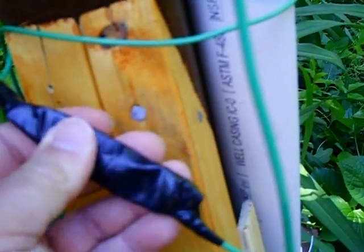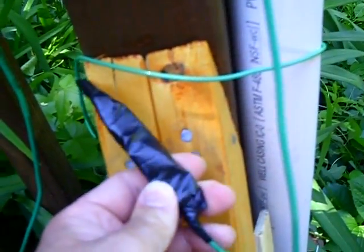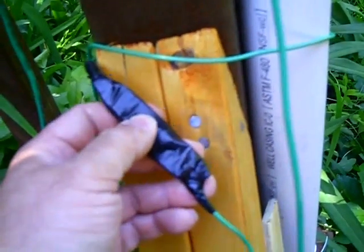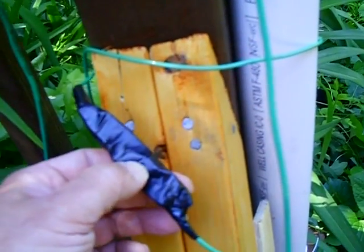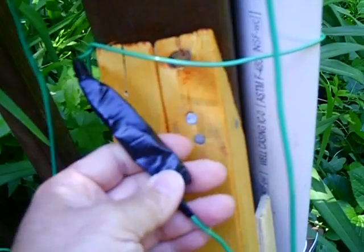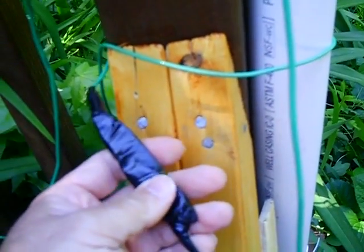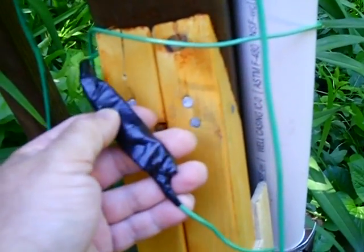On the shield part I put a gas discharge tube in here, and I got that going to ground. I got an eight-foot ground rod pounded about two feet away in this flower bed. This is not for a direct lightning strike, but hopefully it helps with nearby strikes. These gas discharge tubes are very small — I got it inside, wrapped some plastic from packaging around it and wrapped it with electrical tape for waterproofing after I soldered it to the wire. They're good for something like a 5000 amp pulse, so it could help if I had a nearby strike.